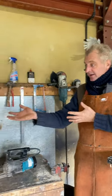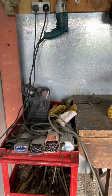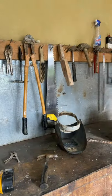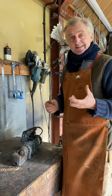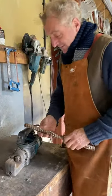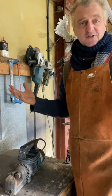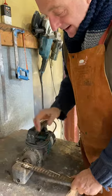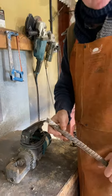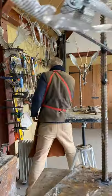The basic tools I use include an arc welder — fairly agricultural — with stick rods in various sizes for different thicknesses of metal. It's not a particularly pretty weld, but it doesn't need to be; it's only functional. I also have various bits of kit to bend metal. The great thing about an arc welder is you can heat up a metal rod, make it red hot, and just bend it. This is one of my favorite tools — a rebar cutter. When I first started sculpting I would cut bar with an angle grinder, which created lots of dust and dirt. Nowadays I've got this, which is basically an overgrown pair of scissors — very quick, useful, and clean.